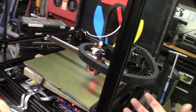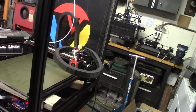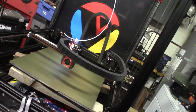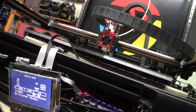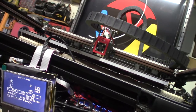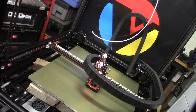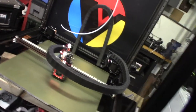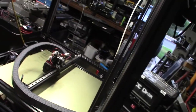When I got this printer it was already partially disassembled, so I didn't see how it came together. I'm assuming there are probably spacers to bring the bed up, so I just put some wood on there. The BLTouch came down and should bounce and come back up to check again — but it's still going down, which makes me think we're not getting a probe signal back. I need to check the end stops with M119 — I feel like the BLTouch is not resetting. I need to check in Marlin that it's actually defined on the servo pin.